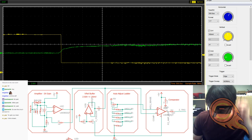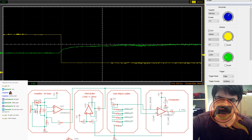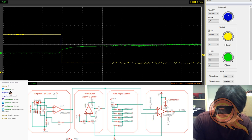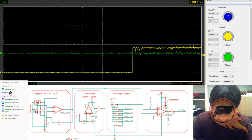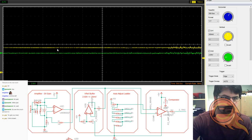I'm going to stick a probe. The green one is going to stay on the piezo input, so the PZ, or the little plus on the very far left-hand side of the amplifier. And this spot here. And here's our voltage follower. We'll see a little bit. Maybe set the trigger up. I'll see a little bit of that rise time, so that's what I need to do.